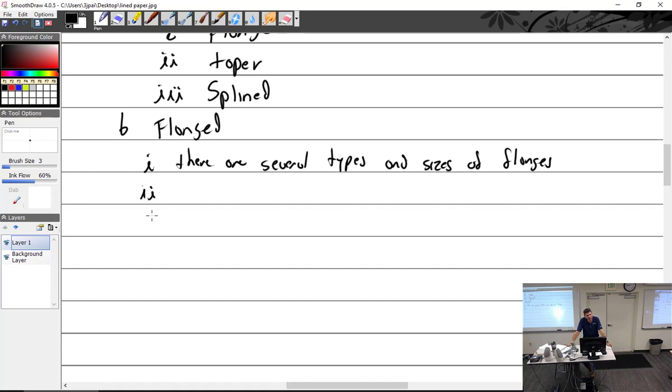And I said, or there's a service bulletin that talks about the different types of flanges, and I think the 235 has two different types of flanges. One is bigger, one is smaller. Did you verify that you put in the same crankshaft flange as the one you took out? Same flange as the one I took out? I'm like, uh-oh, you repeated my question. I know we're in trouble. So coming back, nope, this one is definitely a different size than the one that came out of the airplane.